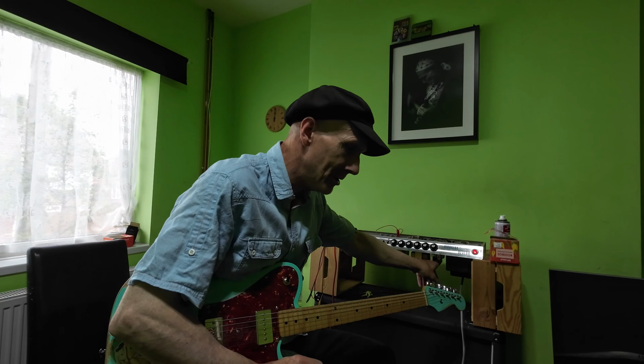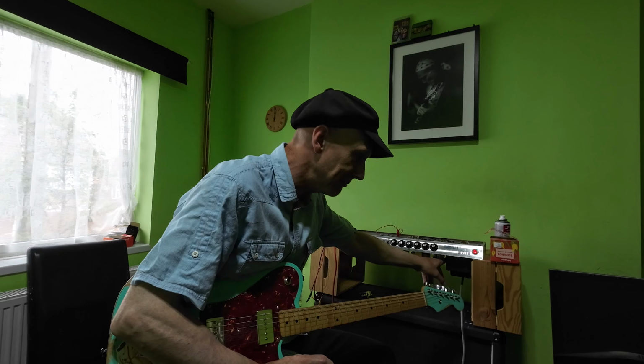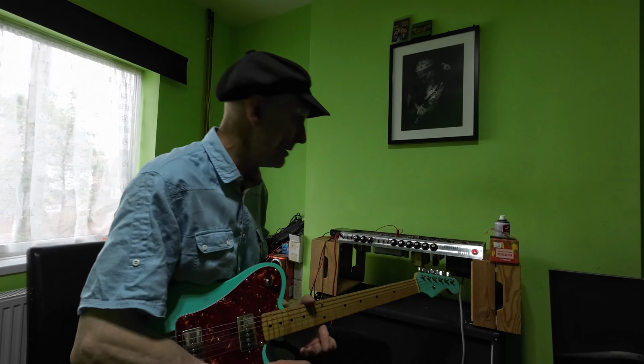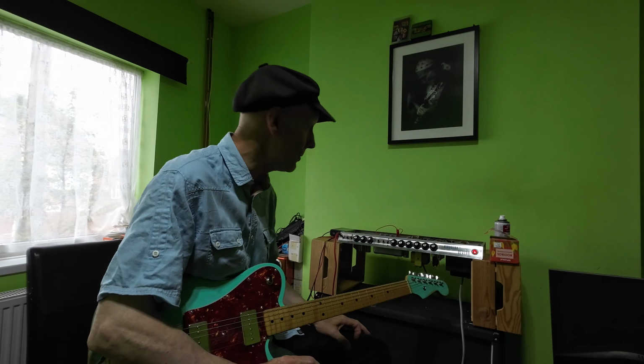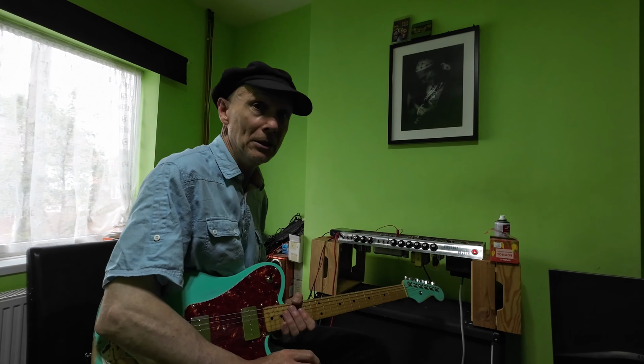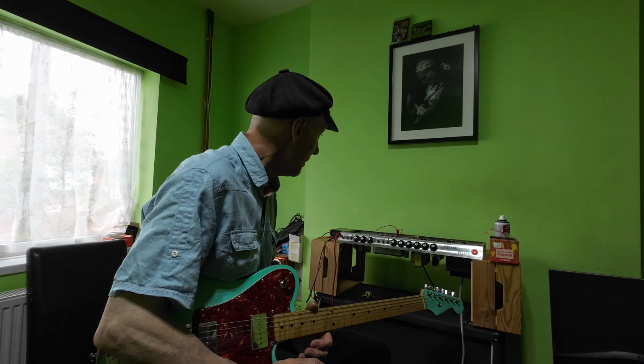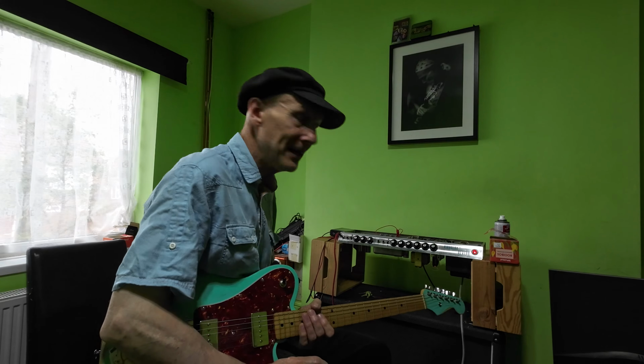The choke was supposed to be getting hot on this amp. It's not really, it's lukewarm now. If it was getting hot before, we didn't plug it in because of the state of those caps. So maybe one of those caps was a dead short or partially short or whatever, I don't know. So yeah, that seems to be about it for this one.